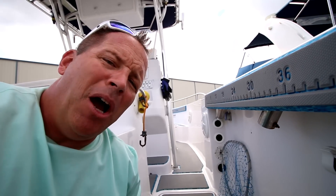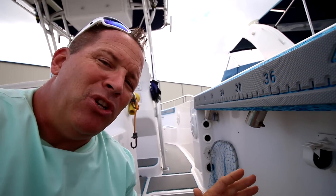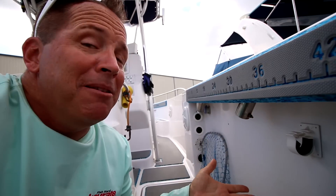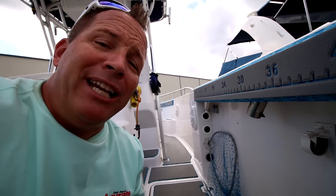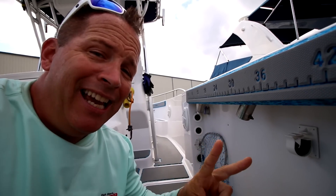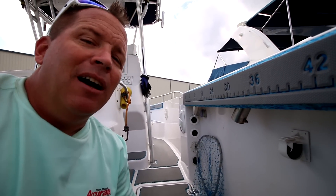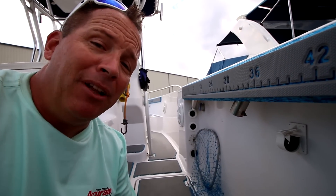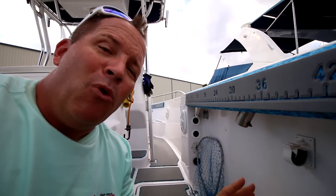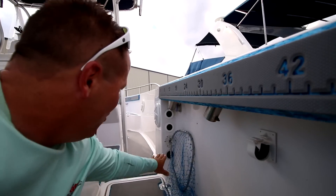Pro Line is considered a mid-tier boat. When people talk about boat quality they talk about first tier — that's your Jupiters, Contenders, CVs, center consoles. Second tier is mid-level boats like Pro Line. Then there's bottom tier boats — they're built like crap. There are two types of construction for a center console: three-piece and two-piece. Pro Line is two-piece construction, which is typically considered the lower quality build. Three-piece is your top-of-the-line, considered better constructed. Generally you want more fiberglass and less wood.